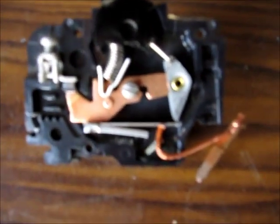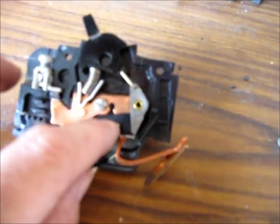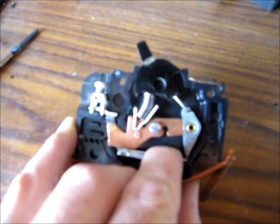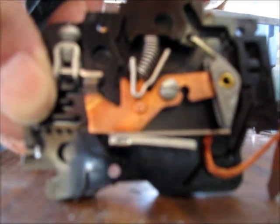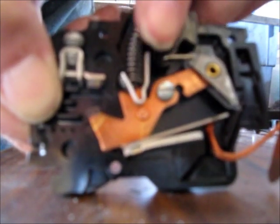So that's my interpretation of how this device works. If the load gets too great, this little plate is calibrated to bend away from this little tab at a certain amp rating — in this case, 20 amps or greater. As it starts to pull away, it opens up the terminal and your house doesn't burn down because you short-circuited the television or something.